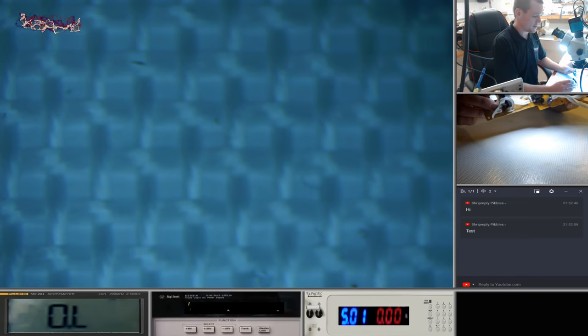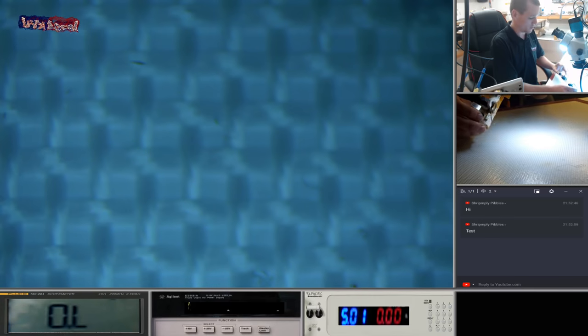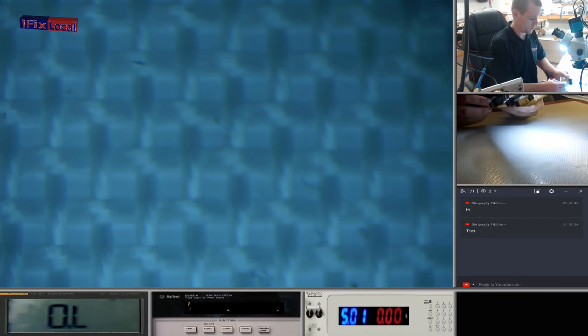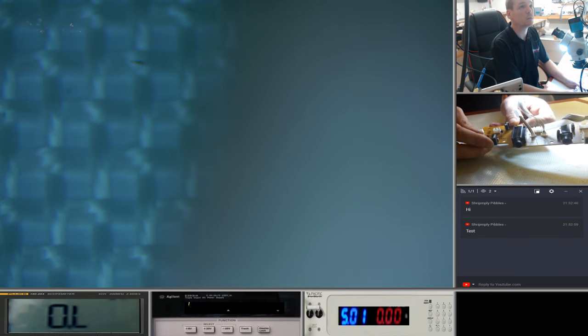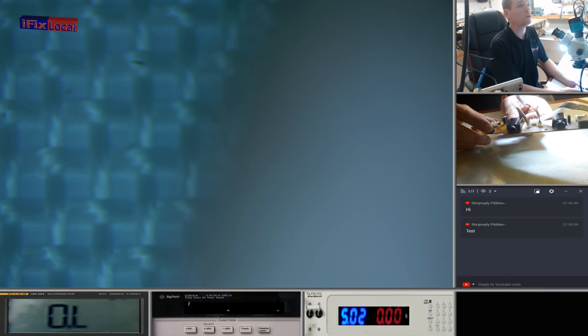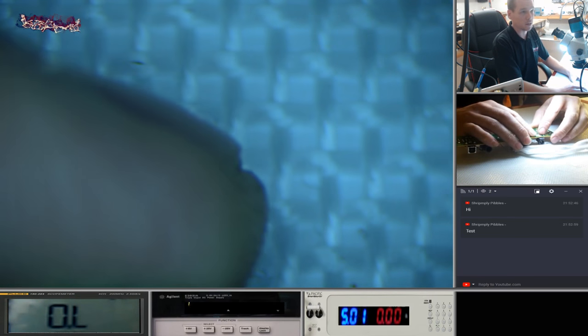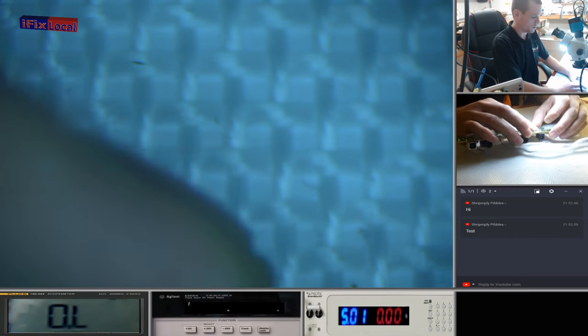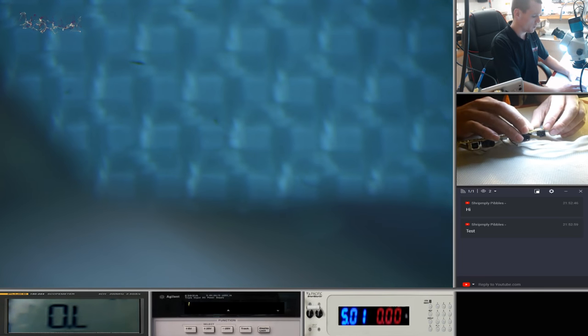This is a Yamaha keyboard motherboard. The person, I think, dropped it at a gig or something, but the DC jack input's been bent and it's taken it out of the motherboard. So what I'm going to do is hopefully stick the pads back down, and then what we're going to do is probably bridge them to the ground plane or the planes near them and resolder them in. Hopefully that'll make a decent connection.